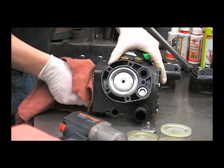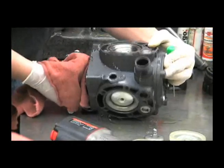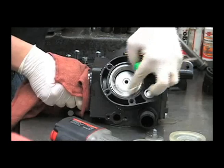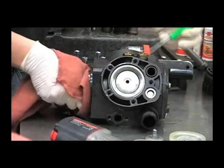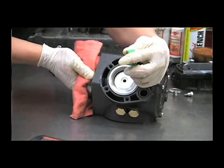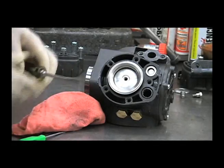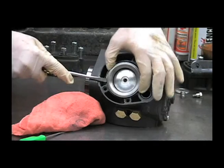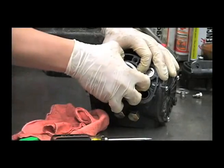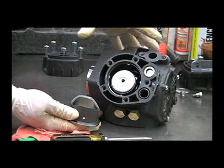To remove the sleeves, you can rotate the pump shaft until one of them comes loose enough to be able to get a screwdriver behind it. Or, if you have a lot of corrosion or they just aren't coming loose, you can take that small screwdriver and stick it in between the piston and the sleeve, then get a screwdriver behind it and gently pry it out. Repeat the same steps for the other two cylinders, then bring it into the parts washer to clean out any of that contaminated oil.